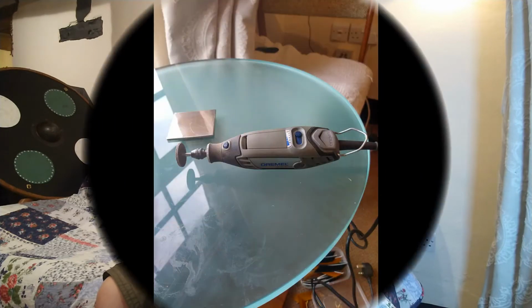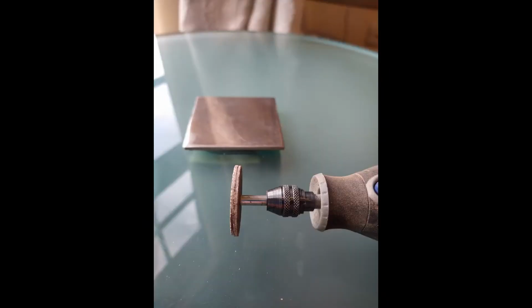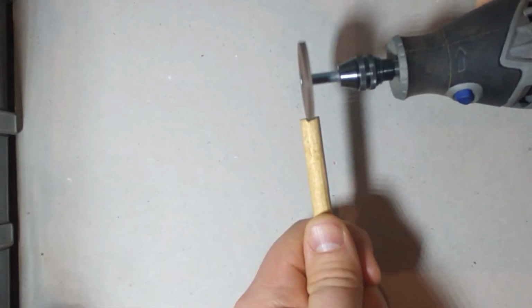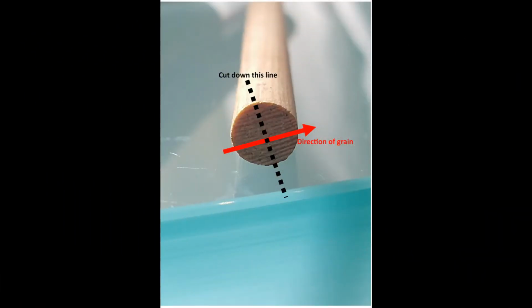You can do that either with manual tools, such as 2 hacksaw blades cut together, or using a method similar to what I use, where I take a Dremel with 2 cutting bits on the same bar and just cut into the wood. Now, as you can see from this image, make sure you cut across the grain, not with the grain. Again, it won't be foolproof to make it last longer, but if you cut it this way, it is much less likely to split, because there's an awful lot of force going through the arrow when it's knocked onto the bow and released from the bow.